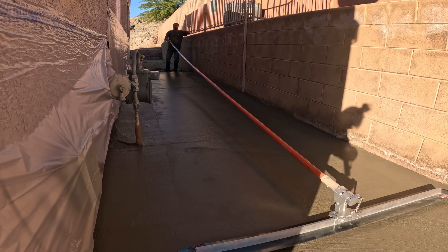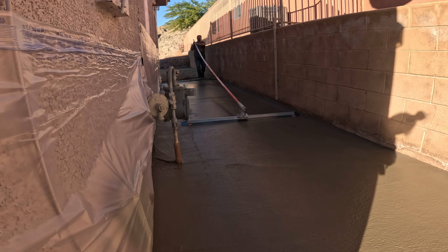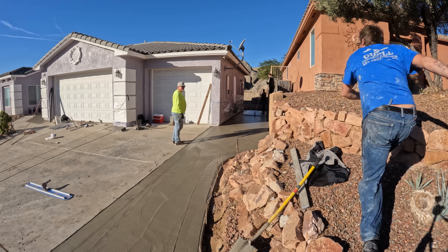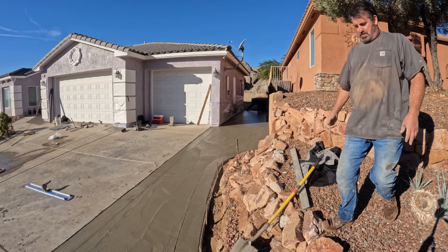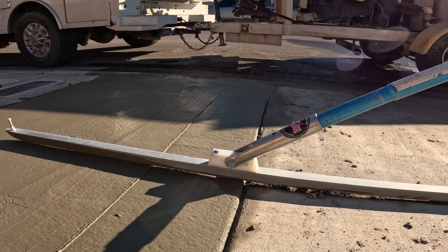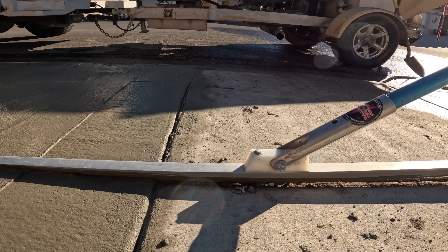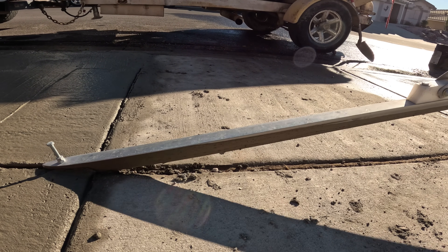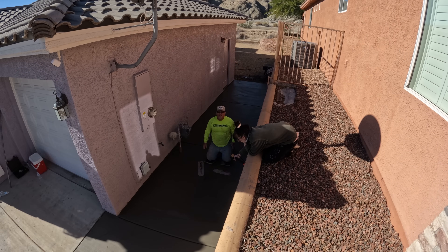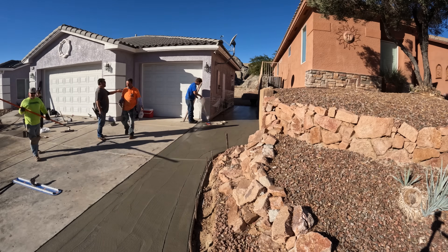Here's the Fresno — I got a chance to use it and it's five foot wide for a six-foot opening, so it's covering a lot of area. It's very lightweight and he modified it with a rocker arm, which makes it very easy to control. Here's the new cutter — five foot long as well. Nice tool, very light, easy to control, and it cuts the concrete nice and straight. I got a little carried away with it — I put a lot of joints in because it was so easy to do.